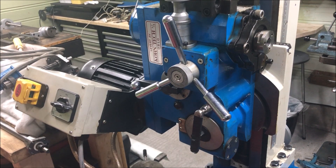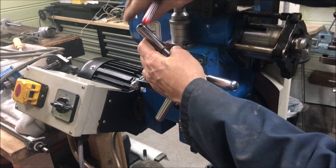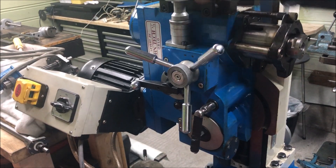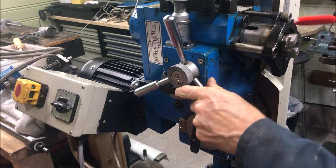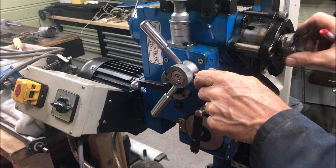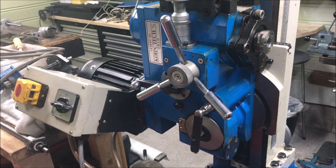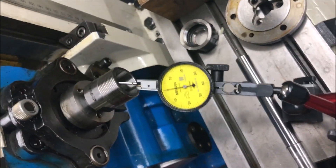And then the head — as said, the quill and the fine feed. Just engage, and spring load it back. In comparison with the HPM, you have supports here, and also more accurately machined. This is actually very accurate — the taper, and there is hardly any run out here. I can fire it up so you can have a go. It worked.